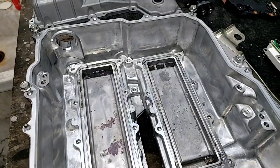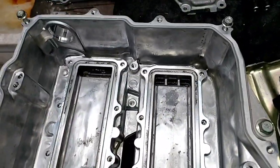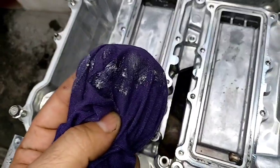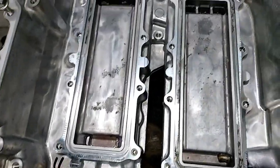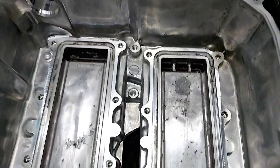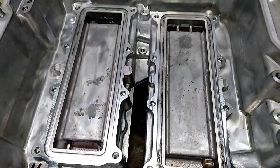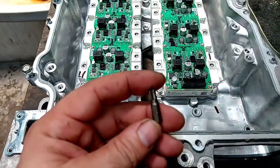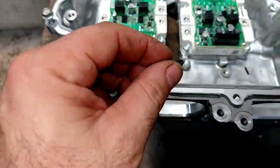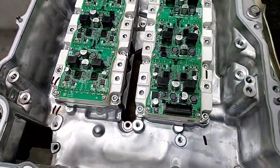I cleaned the surface inside the cooling chamber. I'm not taking any chances — I'm going to use gray silicone to seal this. As a technician, I'm pretty sure you guys will agree with me. After using a T30 star head to give a considerable amount of torque to these IGBT assemblies, and as always, I made a mark on these complex devices before disassembly.